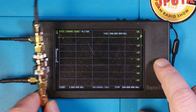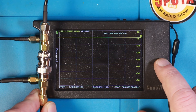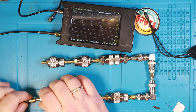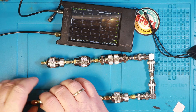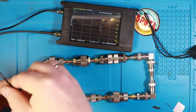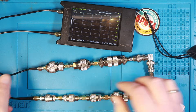At 500 MHz it's 0.15 dB, so to conclude: this set of two adapters does not have much insertion loss worth writing home about. Let's check the other one — the large adapter chain of 20. I need to zoom out quite a bit in order to get this hooked up. We're going to hook it up, then take a look at the NanoVNA and see what the attenuation looks like with 20 adapters of varying quality in a chain.